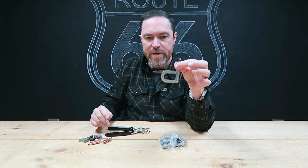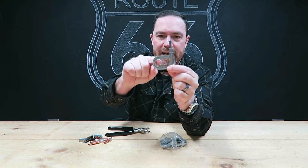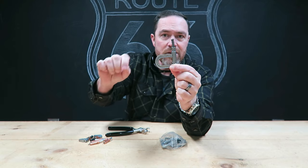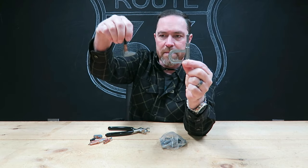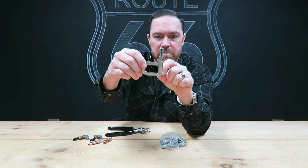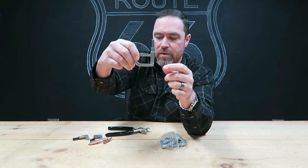This is a two-inch reach. What's awesome too is you could use this somewhere where there's maybe a bead on the edge — something a standard clamp couldn't handle. If you had a bead rolled around the edge of a panel you couldn't clamp it with a regular cleco, but with this one you could, because of the big throat on it. You can clamp right over top of that bead and it wouldn't affect it.